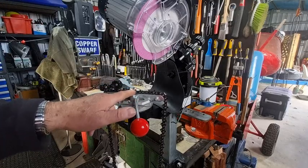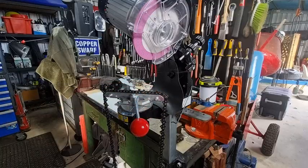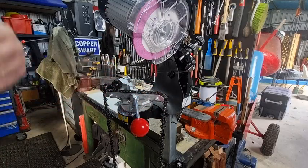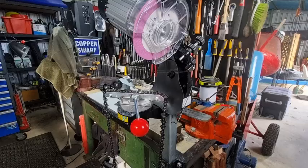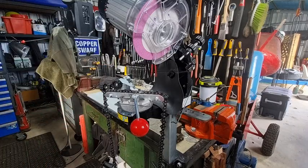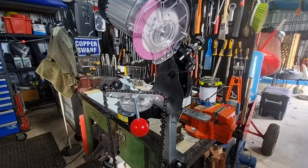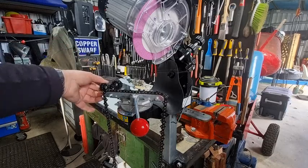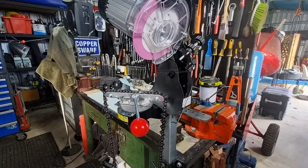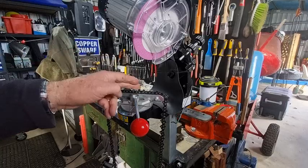So if you mark this with a red texta, when you start to go through the other teeth on the same side — whichever side you start first — if you find a tooth that's too short or too long, mark it with a different coloured texta. Continue sharpening the chain. When you finish sharpening the chain, take the chain off and inspect it. Make sure it doesn't need a second pass — if you're not happy with all the teeth you sharpened, maybe give it a quarter of a turn and do a second pass. The teeth that you marked as too short or too long, then you can start to address those.